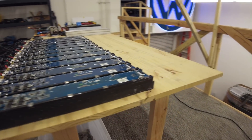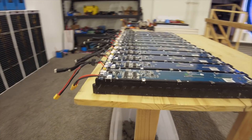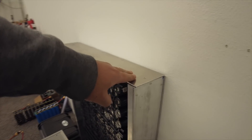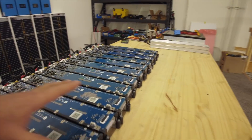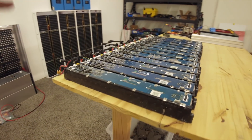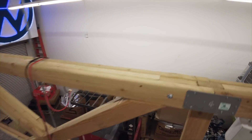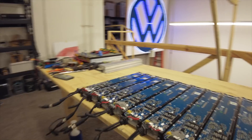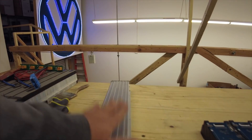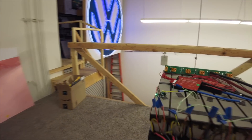These are the new scooter batteries — 36 volts, 460 watt-hours of storage. I'll be able to build a box, just taller, put a bunch of them in there, and build a 36-volt power wall very easily. I'll source some 36-volt inverters and do the whole thing — it's going to be a full project. I have a small portion of what's available and it's almost filled my entire little warehouse, so more are coming in the future.